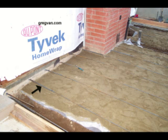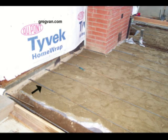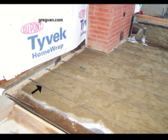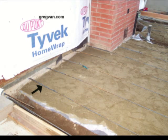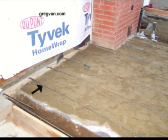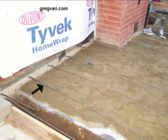In this video, we're going to talk about lapping rebar and what the basic requirements of that actually are. The black arrow is pointing to two pieces of rebar — one that was doweled into the foundation of the existing house, and the other which runs across the new concrete foundation for the room addition we were working on. The correct lap distance for two pieces of rebar is 40 times the diameter of the rebar.